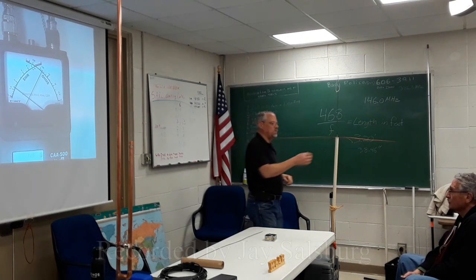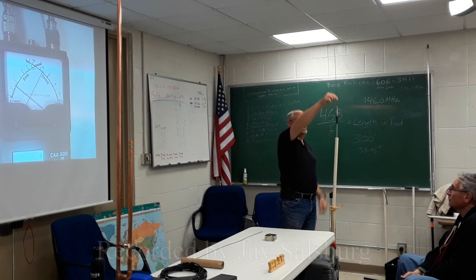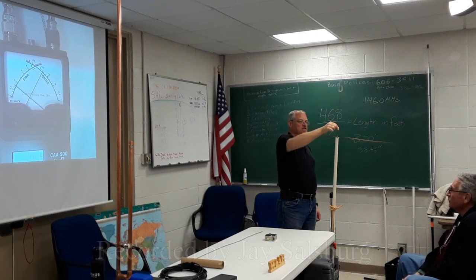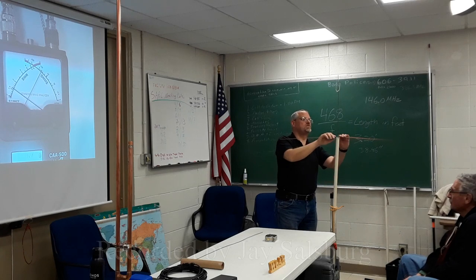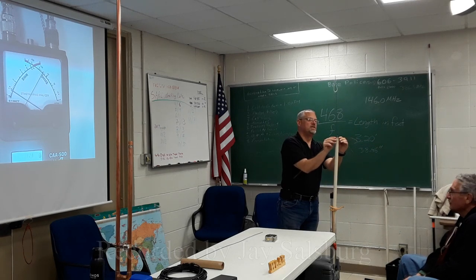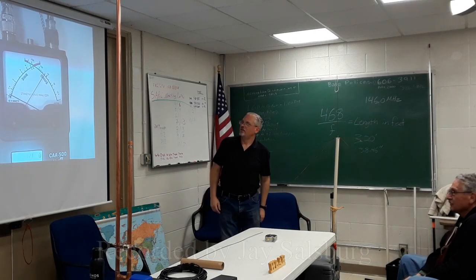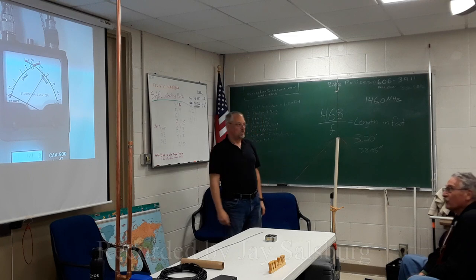Now, I put little doohickeys in here, but it didn't help my SWR, did it? No. The resonance is still there. So what happens if I just say, well, let's split the difference. Let's just fold down half of my radiators. Yeah, that helped quite a bit. Now you're about 60 ohms.